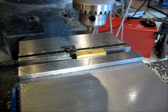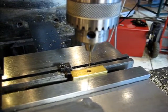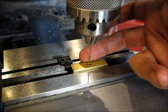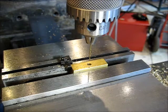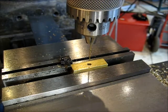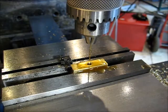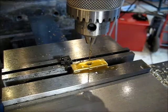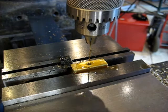And then I don't know if you can see that drill. Let's see. There she is. Little bitty. I don't have far to go. You only have, it's a long ways. It's several diameters through to the 100 hole. So I'm going to peck like Woody and make this. I only have a few of these little drills, and I don't want to blow them, so let's peck away.